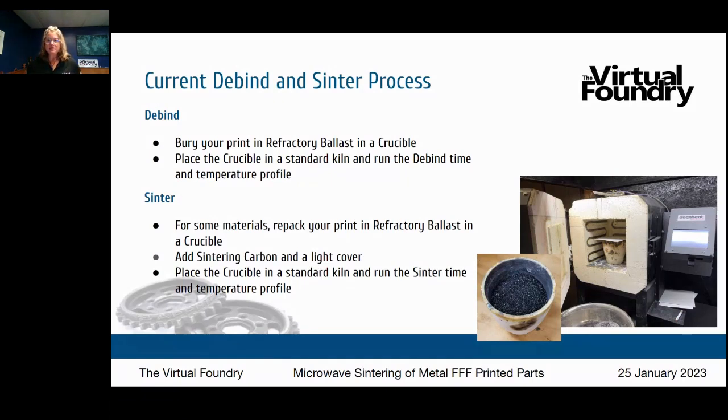A question came up: how accurately can the user calculate the size change after sintering? It's about shrinkage — as metal particles fuse together they will shrink. If you follow the instructions on our website, you can expect 7% to 10% shrink, so you size your part up about 7–10% in the modeling stage, print it larger, and expect it to shrink by that amount. You have full control and can adjust the time and temperature profile to further densify your parts, which will also shrink them a bit more.